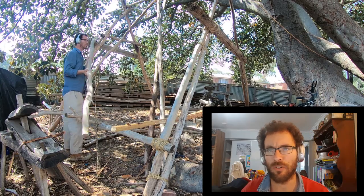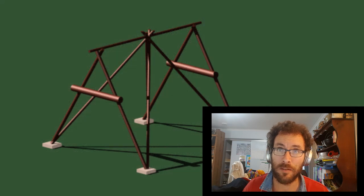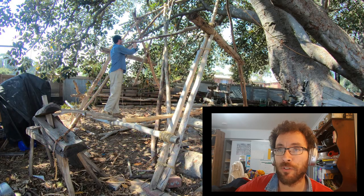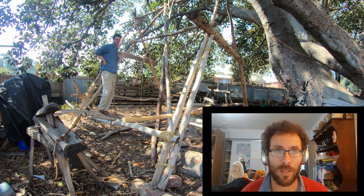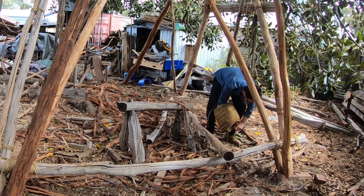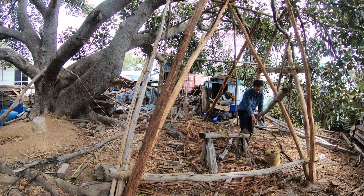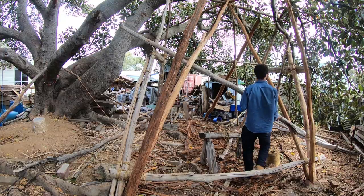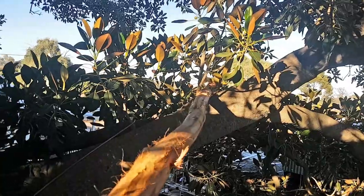Plan A was to put these horizontals in — and these are actually part of the permanent structure. They tie it together, dividing the triangles into more triangles, making it more secure and firm. They're also going to be the first of the battens that the thatch will be attached to at a later date. I figured I'd be able to stand on these and lash the dormer poles together, lash them to the ridge pole, then push the ridge pole out and stand the dormer up off the existing frame. That didn't work though, because of the overhead branches.